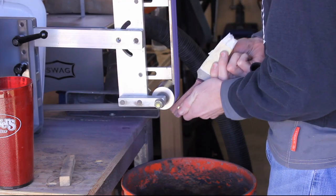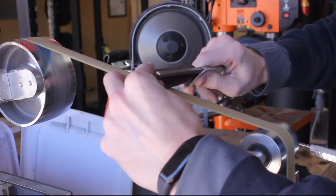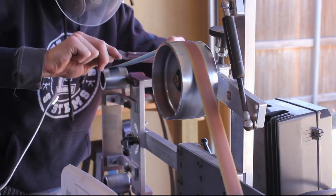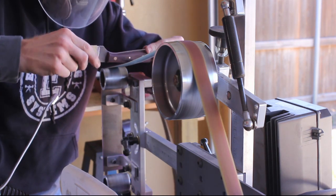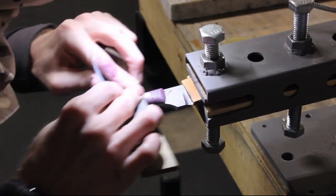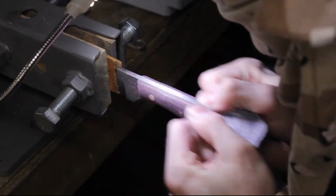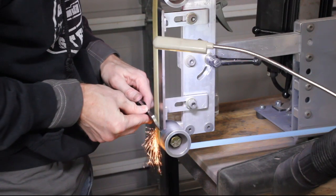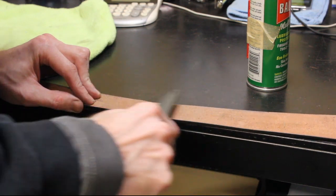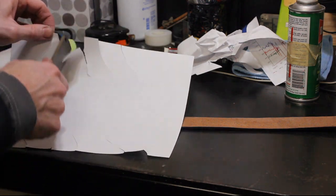This wood is super tough. I have to be careful not to grind it too hot or too hard, so I turn the grinder down to about 30 to 40 percent and make sure I have fresh belts. It's surprisingly hard every time I use it, and it makes your whole shop purple. I hand sand it to make sure it's smooth in the hand. I then put an edge on it with the belt sander running at very low speed, getting up to about 400 grit, then strop the knife — sharp enough to shave hair.